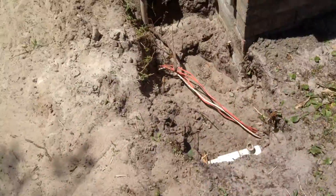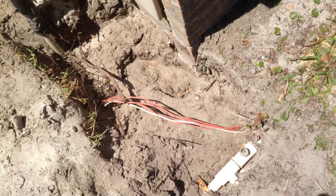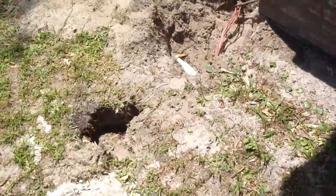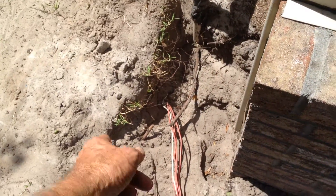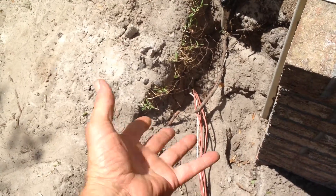Discovered some problems here. They buried the sprinkler system and put that electrical line there — didn't do it to code, so I've got to fix that. That's supposed to be in conduit. It's dangerous stuff. There's four 110 lines and a common, and this stuff can hurt you. It's only three inches below the ground.